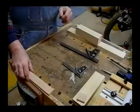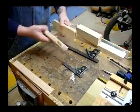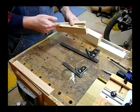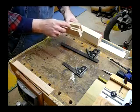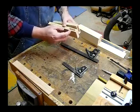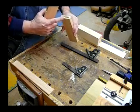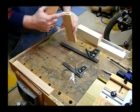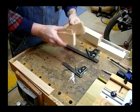Let's start looking at our markups here for our pieces. Let's go to our prototypes first. You'll see here that we have marks for the center of the thickness of the stock, our mortise beginnings and ends, and the center point, and the same as the beginning and the ending and the center point for our rail. Our tenon stock slides in there and it makes the joint.